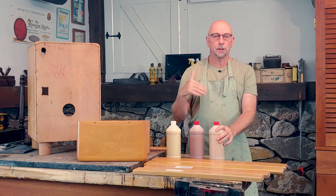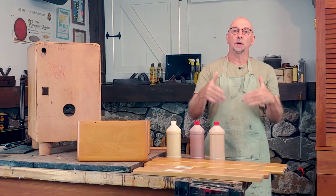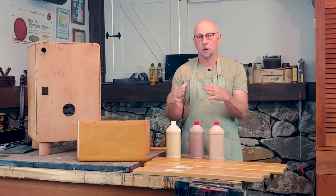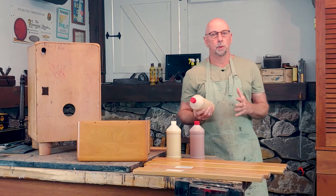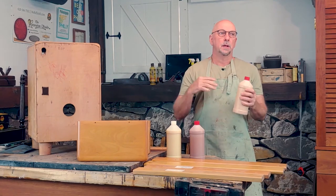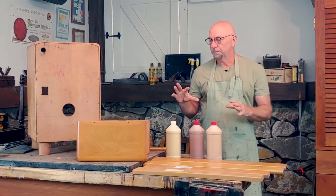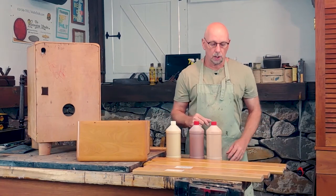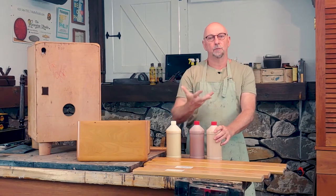Follow the videos, watch them, and once you've done it, it's super easy — you just can't base your refinishing routine off of things you've done in the past. Most notably, work in small areas and small sections because this is going to dry fast. It's a waterborne, water-reducible stain and finish, so it evaporates relatively quickly. If you go too slow, it starts to evaporate, dries, doesn't come off right, and gets streaky — that's a user problem, not a product problem.